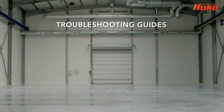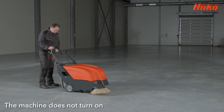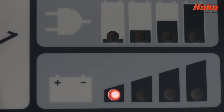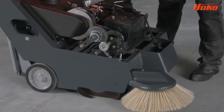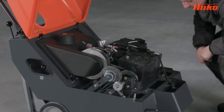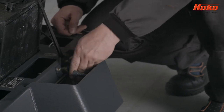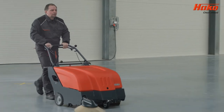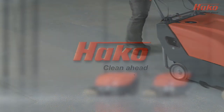The next section shows how to carry out troubleshooting. The most frequent problems include the machine does not turn on and the machine is not sweeping thoroughly. If the machine does not turn on when the key is turned, check that the battery is charged. If the sweeping effects are unsatisfactory, check the brushes for wear or adjust them. Open the main cover with the key provided. Adjust the side brush pressure with the knob located next to the brush. The adjustment of the sweeping brush's main sweep width is located under the cover of the machine. Use the knob to increase or decrease the sweeping width. Detailed information on brush adjustment can be found in the user manual. Following these recommendations will ensure trouble-free and effective work with Sweepmaster B650 and B800 machines. All information not included in the training video can be found in the user manual.